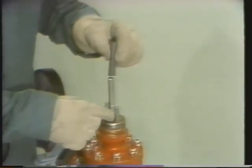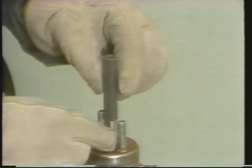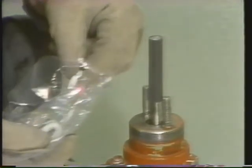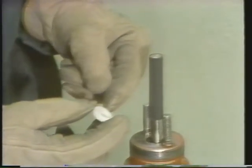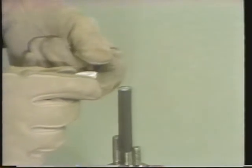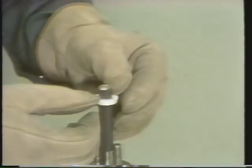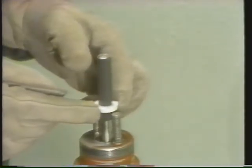Now that the bonnet and body of this globe valve are reassembled, we're ready to reinsert the contents of the packing assembly. Before we do that, a cover is put on the threads of the stem for protection. This cover prevents damage to the new packing rings when they're inserted over the stem — any nicks or scratches on the packing could interfere with its ability to seal. Since this valve is being reassembled for use in the process, new packing is used. The type of packing we're using is called split ring packing, which can be moved apart and inserted at the middle portion of the stem when removal of the actuator and packing flange is impractical.